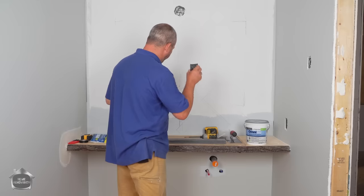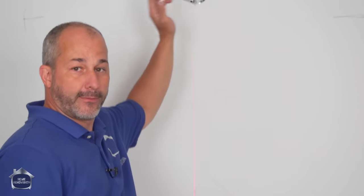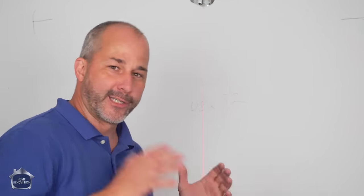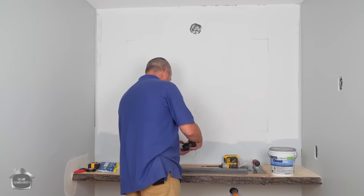Now, of course, if you're a fan of the channel, you've seen my videos before, you know I love my laser, and we're gonna just throw that on here. I've already made my center line. You'll see that it's in line with my box, which of course is gonna be in the center of my light. And I like to install everything very, very symmetrical, especially in a bathroom. Small spaces, you cannot afford to work left to right. You gotta start in the middle and work your way out. So now I got my line established, that is good.